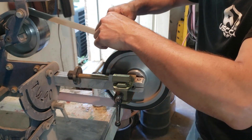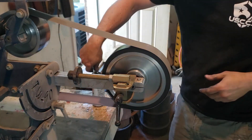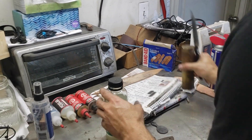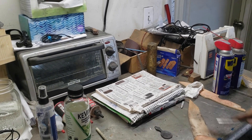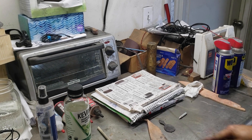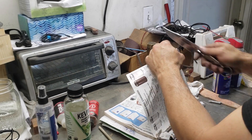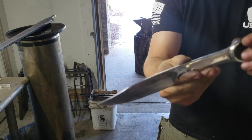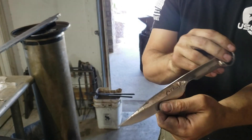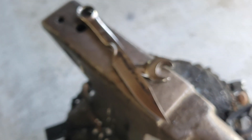I've got a 3M Trizac belt on here that I'm using to put a finished edge on this blade. You have to be real careful with belt sharpening because it's real easy to get a little bit of a recurve in your knife if you're not careful. The first thing I did was take a ceramic rod to it and just take the burr off, and now I'm just using this little makeshift leather strop. Little test cut — no problems at all, actually did a really great job. I was real happy with this knife build. It's a cool little piece, still has the CRV marking on it — it's a beautiful 22 millimeter wrench knife.